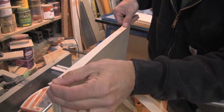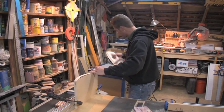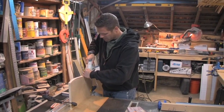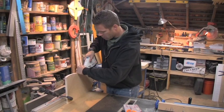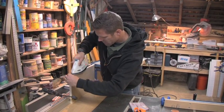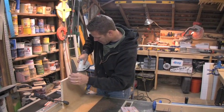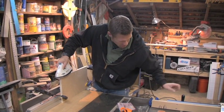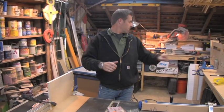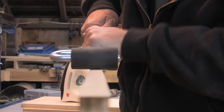All you do is stick it on — it's a little bit thicker than the actual plywood so it hangs over the edges. Find the middle roughly, grab yourself an iron. I stole this from my wife many years ago and after you use it she doesn't want it back — it's $15, very simple. All you're doing is heating up the glue on the veneer strip so it sticks right to your plywood. Go relatively slow so you activate the glue — when you pull the heat off, it cures. Then grab a J-roller to make sure you've got it all nice and flat and embedded.